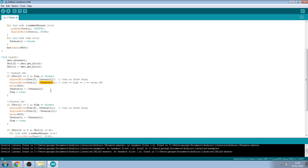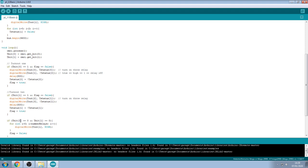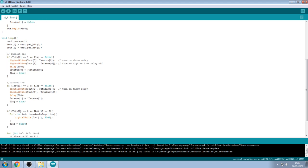It works quite well for this — the only problem was the mechanical working of the PL11, not the code. The flag is then set to true because JMRI outputs a 1 for 0.5 of a second, and the Arduino loop runs through many times during that window. Without the flag, it would toggle the relay on and off repeatedly, causing chatter — turnout open, close, open, close. Setting the flag to true prevents this until JMRI resets to 0.